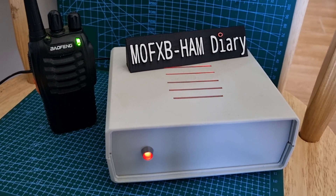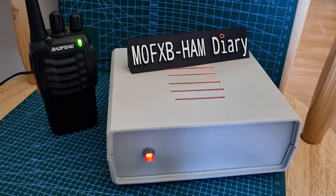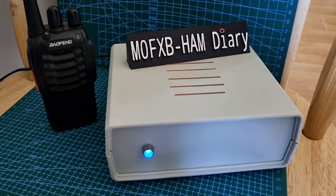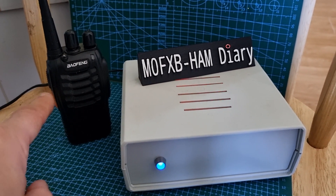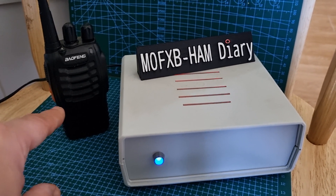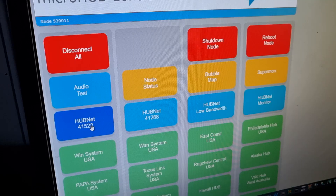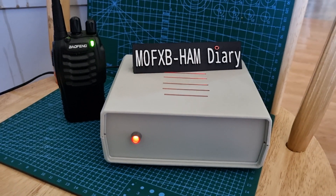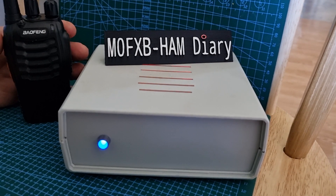The LED goes red. Now I'll select the tile. You can also do it by DTMF — the node number on this is 41522, so you just put that in via DTMF and it will connect. You can pre-program DTMF in most analog radios and all UV5Rs, but for now we'll just use the tile system. I'll show you on the computer — we're going to go here and connect to HubNet.